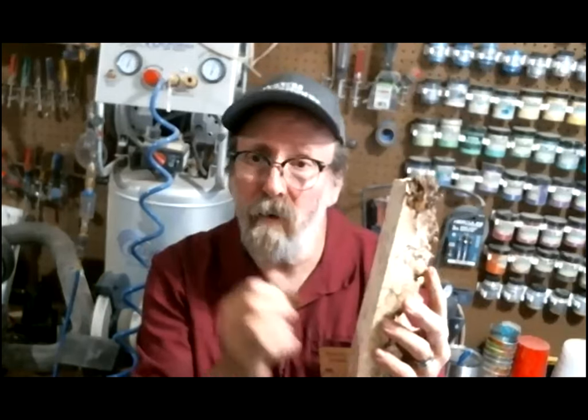But what it's doing is the fibers will absorb it. And then when you heat cure it, in the vacuum chamber, it sucks all the air out. You let off the vacuum, it pulls whatever you're using for your stabilizing liquid in, and then you let that set for a period of time. We can do one on stabilizing too if you'd like, another time. In the future, but, yeah. In the future, we will do that, please. Sure, sure. So then you take it and cure it, and it turns it hard.